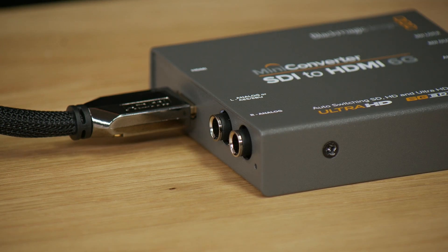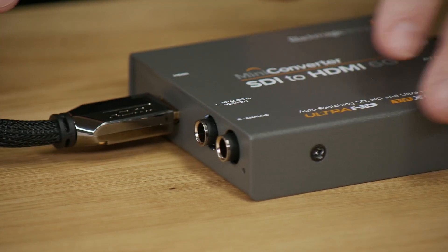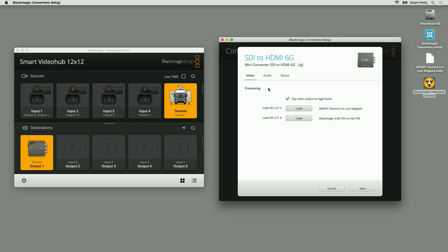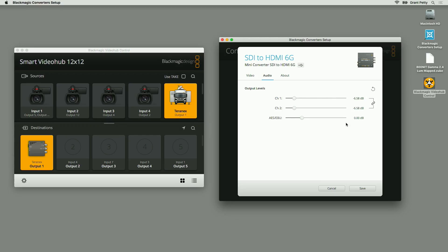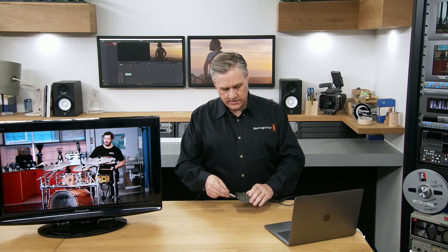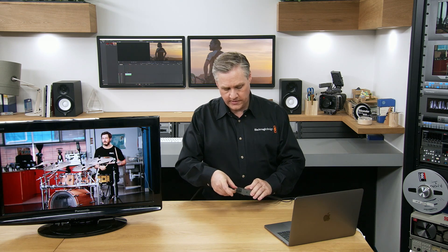The analog output is on standard balanced jack connectors so you can use cables from audio stores. When switched to digital audio, the output is AES-EBU for all pro digital audio gear. You can change the audio output on switch eight — that's where you switch it for AES-EBU or off for analog. You can also adjust the levels in the utility for analog levels. I'll open back up the converter and click the audio page — you can see adjustments for both the analog and digital channels. You can also plug in little adapters to get RCA hi-fi audio outputs for feeding consumer amplifiers.